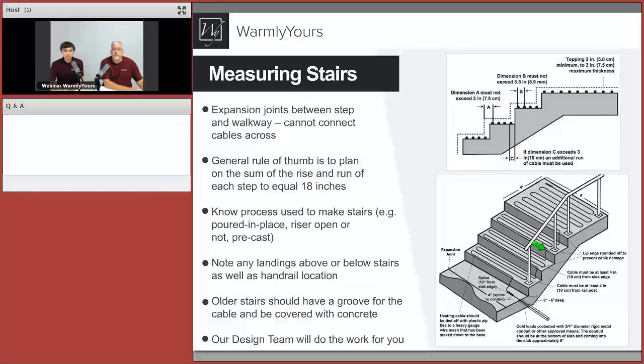Yeah, and so transitioning that cable, we always want to embed that cable still. In other words, any section of the cable that is just sitting in the open air may eventually overheat and fail. In this situation, it's all fine. We have the cable covered. We have the cable fully embedded. If that were open metal pan stairs, there's pretty much no way to transition the cable and still be embedded. So that gives more information about the image that we were talking about previously. What else do we want to say on this?